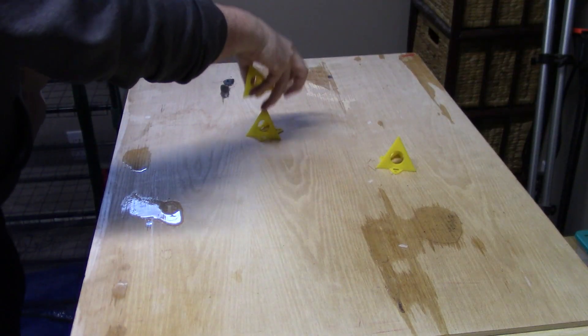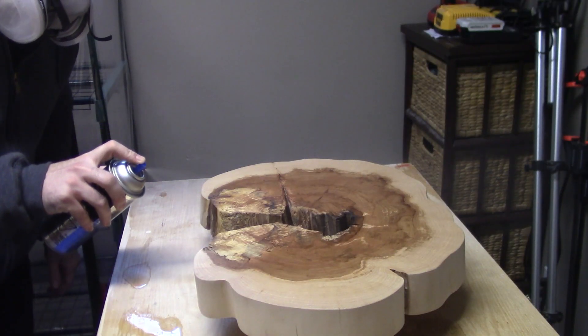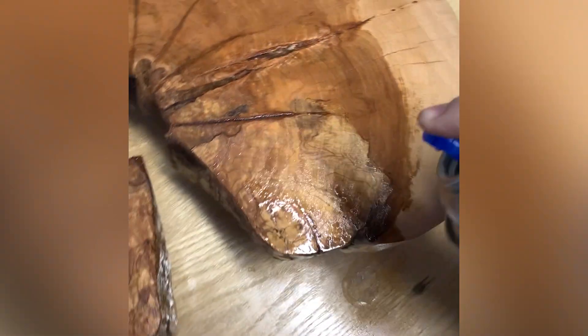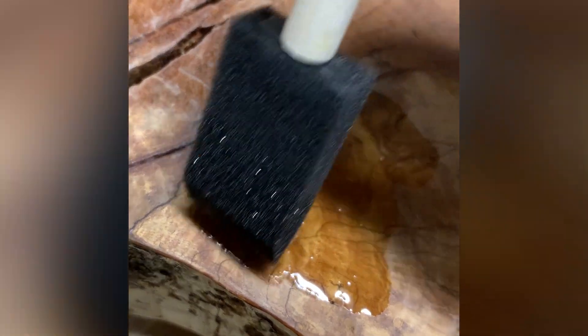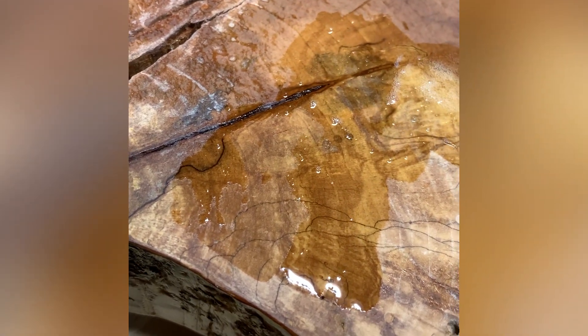With the sanding finished, I could move on to finishing, which was another process that took absolutely forever. Since it was end grain, the spray-on gloss polyurethane absorbed into the cookie like it was a sponge, at least for the first couple of coats. By the third, the majority of the cookie was pretty much sealed up except for the couple of punky sections at the opening of the crack — which, in hindsight, is probably why the cookie blew open right there. The punky sections just continued to suck up the finish, so at this point I moved on to the non-spray can of poly and just kept dabbing it on until it basically either filled up that portion of grain or finally scabbed over. Either way, it took about seven or eight coats.